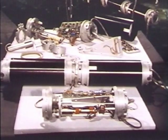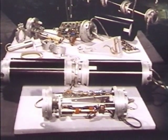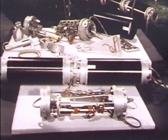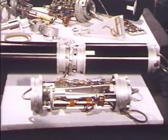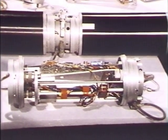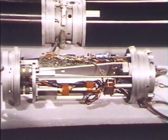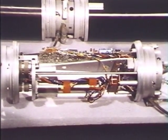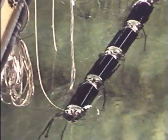There's a little air line which keeps them dry inside. That's the inside of the spine. The bending moment comes along through a waterproof bulkhead with some little rubber bellows. The strain gauge is glued to the root of that triangular plate. It measures the bending moment and sends the message off to the computer, which sends a command angle back to the servo motor underneath the triangular plate.